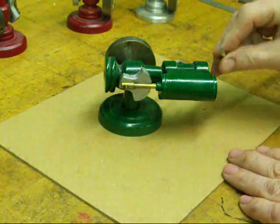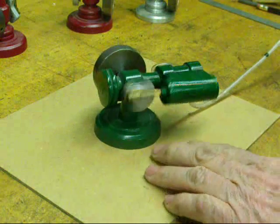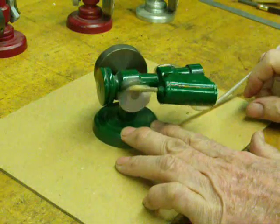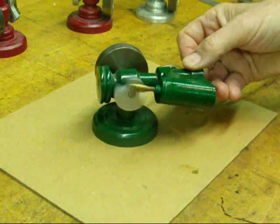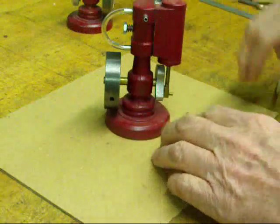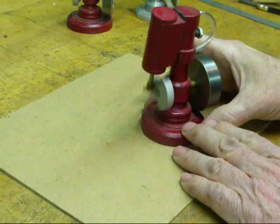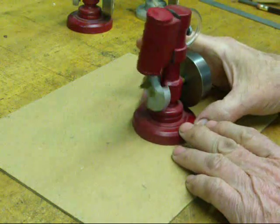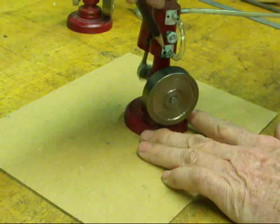Okay, we'll run these now. I've just got a little 1/8 inch air hose here, and the inlet on this particular one is on the bottom. That one was even self-starting when I turned the air on. I'm running that at about 10 pounds per square inch. The compressor just kicked on, so I hope you can hear me. Let's run one of the other ones here. This one too is double-acting. The double-acting ones do have a dead spot on the top and the bottom, but in any other position they are more or less self-starting. The exhaust air is coming out of this little hole and this little hole.